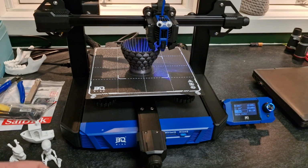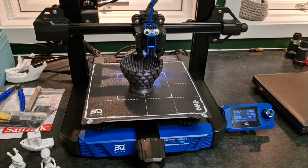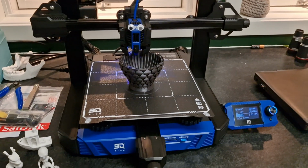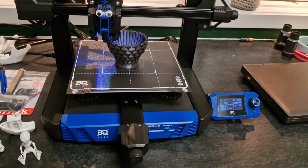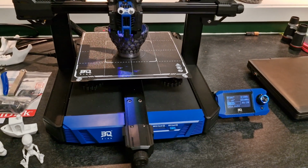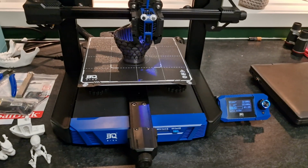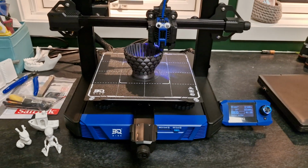You can just update parameters, and if you want the thing to have a higher acceleration or change things around, add extra motors, all sorts of stuff, you name it. You can even customize the menus that are on the screen here, and you don't have to reflash. You literally just save, reboot, and you're done, and it's now the newer firmware basically. So that's what's really cool about this printer, is that it's running Klipper right out of the box.